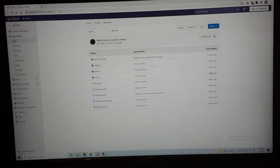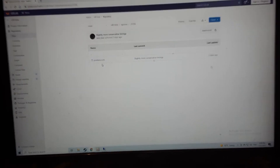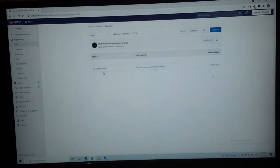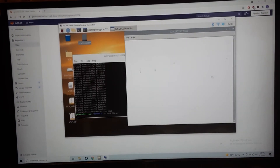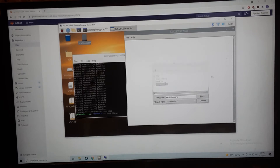So what I did to get started — I'll try to keep this video as short as I can — I just came to his page here and went to this EEPROM link and downloaded this BIOS.ROM file. As many of you may already know, I don't actually have a factory-made EEPROM writer — I made my own off my Raspberry Pi. I added a link to click upload file, opened the ROM, and it uploaded it.